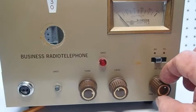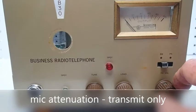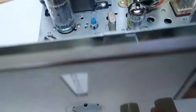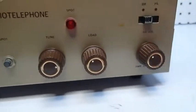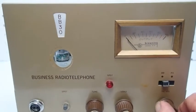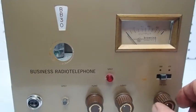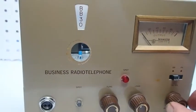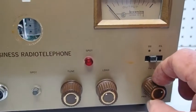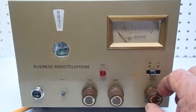The higher you have this control set, or more clockwise, the more microphone attenuation that is achieved. This is not to be confused with the R-22 level control internally. This control is useful for people working in a business environment that may have a high amount of background noise, and the stock Browning banana mic or Electro-Voice microphone was a little bit too hot. This level control would actually allow you to attenuate background noise — kind of an interesting control only found on the BB-30 transmitter.